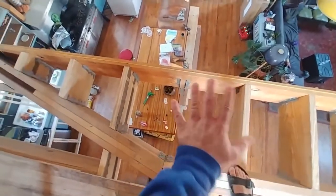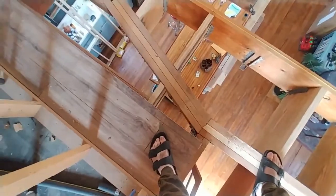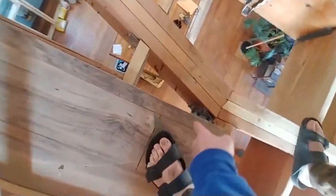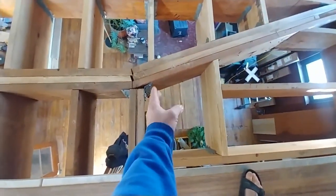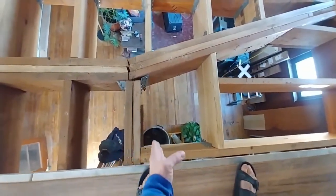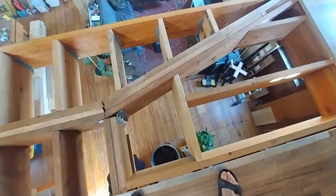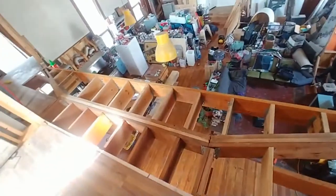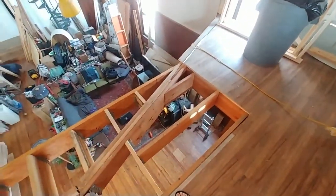And we're just looking to, you know, you can't have nothing here because that 5/8 subfloor, I couldn't even do that with 3/4 subfloor there. It would be creaky and bouncy. So here's where we headed off this joist so we could get in here and apply that plate. Like I said before, there really should have been a joist here, and so we'll see how bouncy that is. We can add a little bit more from underneath, but we're in a kind of a hurry here to put something down on top. So we're going to glue and apply subfloor today.